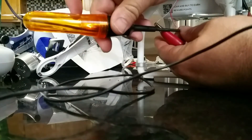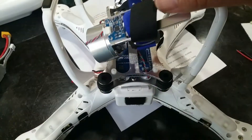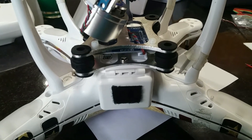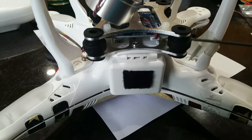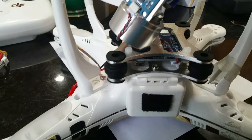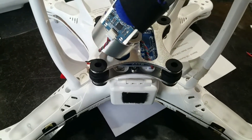As you can see, it's lighting up. So I installed the gimbal onto the mounting plate by using an Allen wrench and just pushing the rubber grommets through the holes. It's kind of a pain in the butt, but once you get one and figure it out, just go around the base plate and lock them all in.